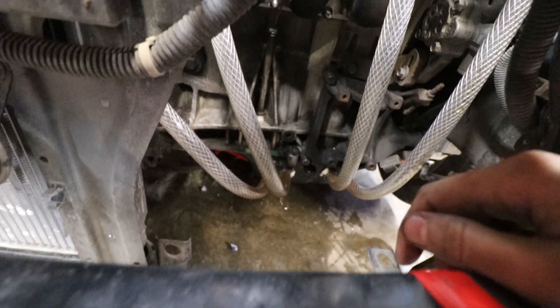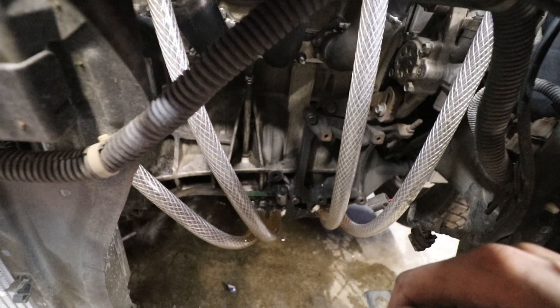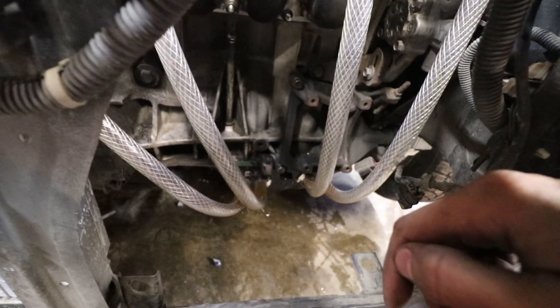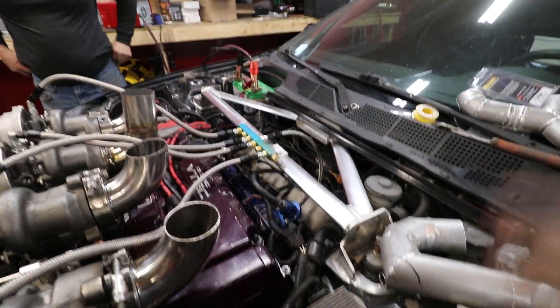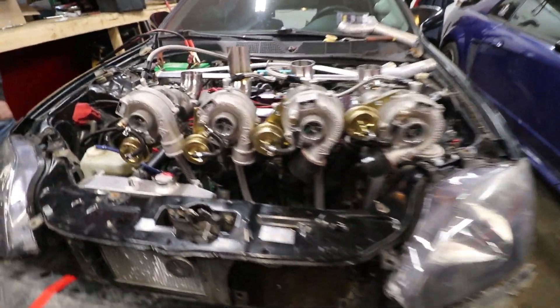I'd say that was pretty successful — lots of oil through the hoses. Oh, it's backing up in the hoses though — you can see it. Yeah, it's not draining. Wonder if we're gonna have oil return issues — like those bungs aren't big enough, and we weren't even revving yet. They're half-inch. Are we starving the engine for oil? Maybe that one fitting is taking too much oil — might take this fitting off and put a restrictor in it, or weld it up and just drill a small hole in it, because that's a lot of oil for these turbos. Yeah, it looked like it was leaking around that gasket maybe — a little condensation or milky oil came down the back of the turbo. Cool though.